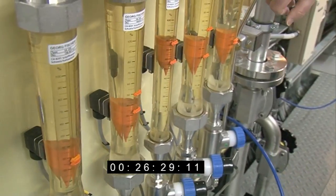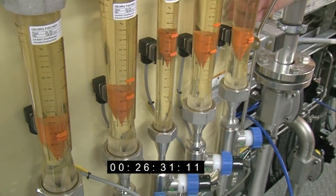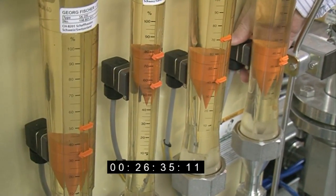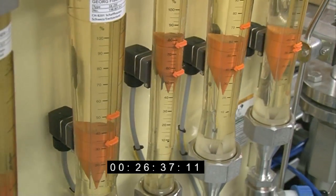You can see a graduation up the top here. Each float has a magnet in it, and there's a sensor at the back that can tell if the float falls too low. If the water flow is too low, it will switch the electron beam off so that things don't get overheated.